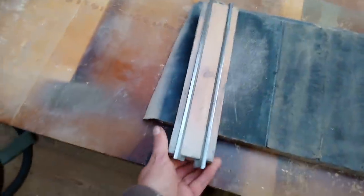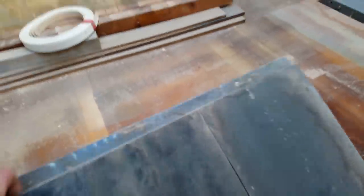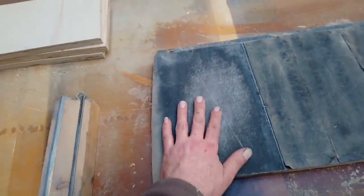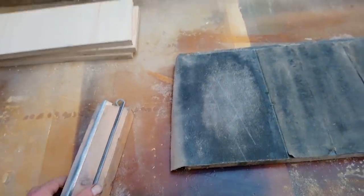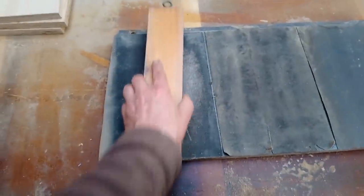I've shown this before - a couple of bits of wood with my blade slotted in, different grits of paper. There are different ones on the other side going right down to about 1000 grit. This first one is the most important - it's like honing when you hone your chisel: get rid of all the rubbish, take it back to smooth, then just polish it off. Then just flat it off to take any burr off the back. I'll put a bit of water on these just to help it slide.